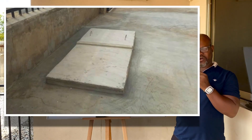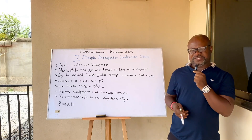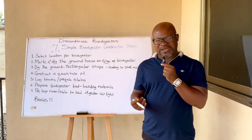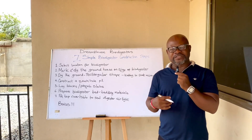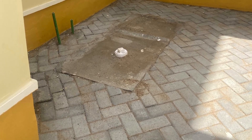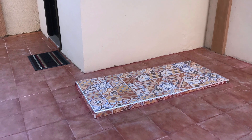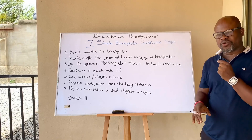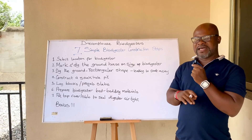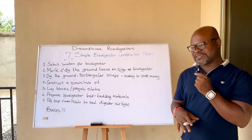Consider the level of the house when the final groundworks are done — how many inches the homeowner, architect, or groundworks team are looking at. You don't want the digester to show only two inches. Are they looking at it flushing with the ground, or will there be some tiling around it, or will it show and become part of the house design? You need to know all these things so the top slab has its place and can be hidden or displayed as required.